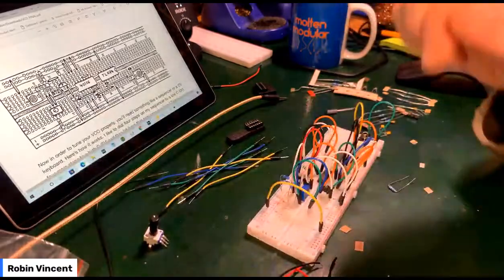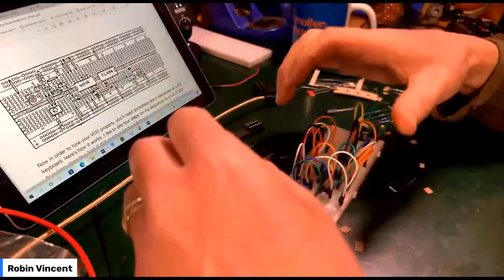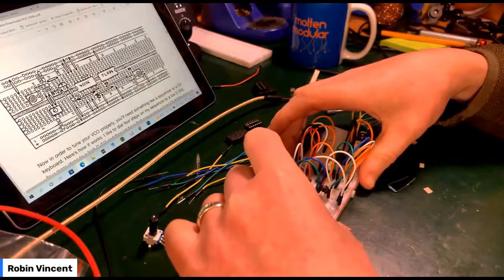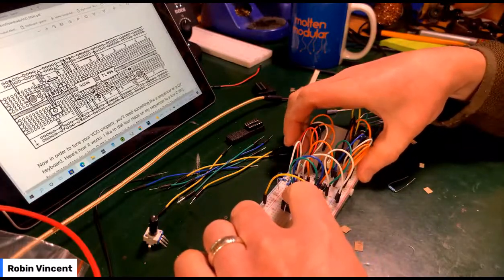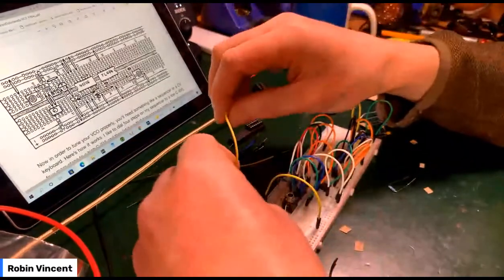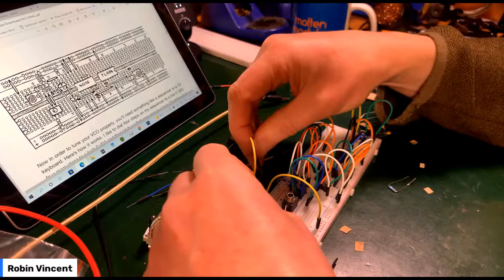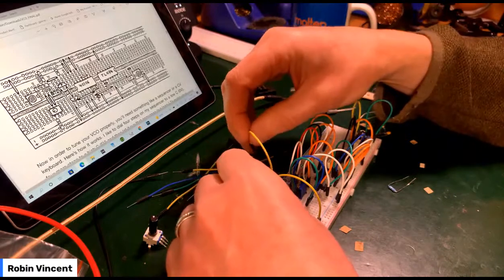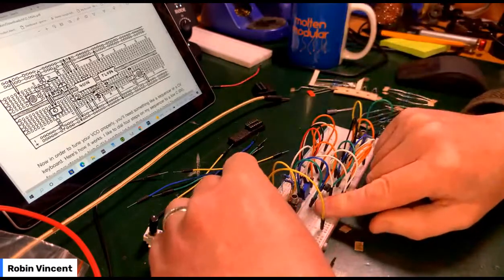So you put that pot back in. This is going to go... So this leg needs to match up with that. Right. I think that's right. Yeah, that's right. And it needs to go off itself to what looks like the negative. So the 0 volt rail, yeah, 0 volt. So to do that, I have to go alongside it. Right. Go to the 0 volt rail.